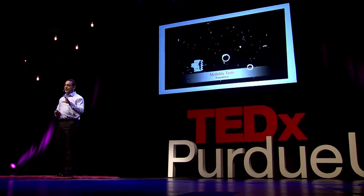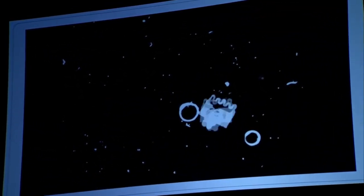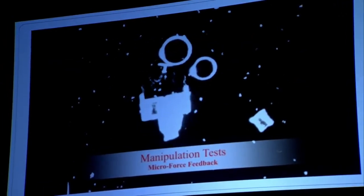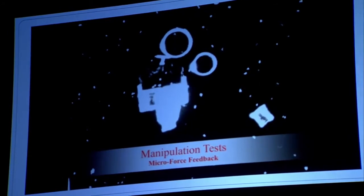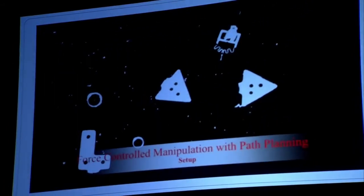Here's an example of one of these robots — the Micro Force Sensing Mobile Micro Robot. It's about 700 microns in footprint, so seven human hairs wide by seven human hairs long. On the back end is a little magnetic body, which we use with electromagnets to control its position and orientation. The end effector — that little spring structure — is the soft, compliant end effector. As we're pushing on a microsphere representing our cell, it's deforming, and we track that to figure out how much force we're using, making sure we're operating on cells very safely.